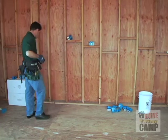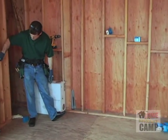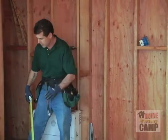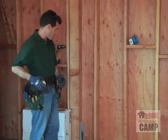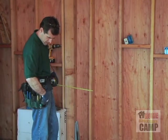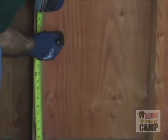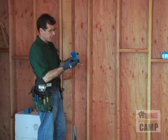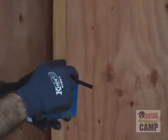You're going to require it. So we know we're going to be putting our outlets right here. We know that our top of box is going to be 17 inches. And did we figure out whether hammer height was exactly right or not? I think I went through that before. In this case, it's pretty close. So we've got 17 inches to the top of the box. We are using adjust-a-boxes in this project because we're using 5/8 sheetrock and we are using a veneer plaster. So our heights are not exact.